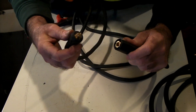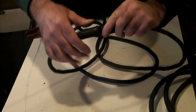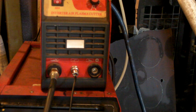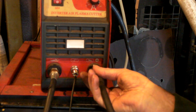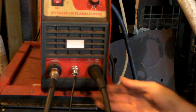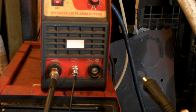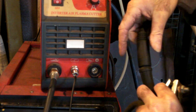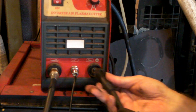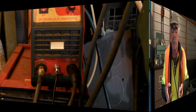So I've made this out of scrap wire, giving me about another three meters. Male and female plugs joined together. Now let me show you it in use: there's my plasma cutter — here's the original lead, screw it in, that's the original three-meter lead with the clamp. If I want to extend it to six meters, I grab my new extension, plug it in, tighten it half a turn, then plug the other end into the machine and tighten — half a turn. Now I'm running six-meter leads.